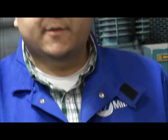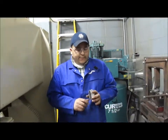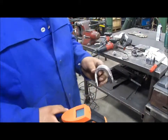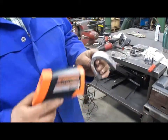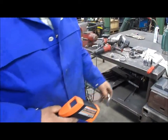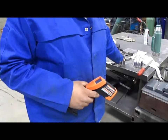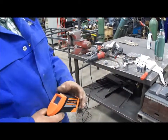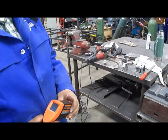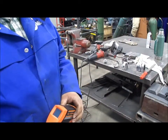We're going to take another specimen that we've got right next to this one. We're going to heat it up and show you what happens when you quench it. We've got another specimen — it's right off of this one. We're going to heat it up to what we hope to be around 2,300 degrees based on color, and then we're going to quench it in 33 degree water and see what happens.